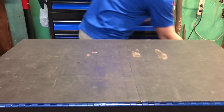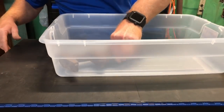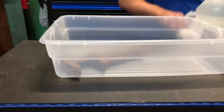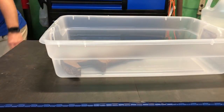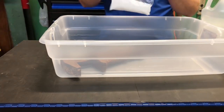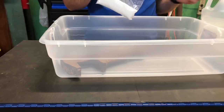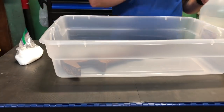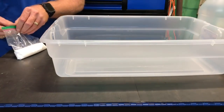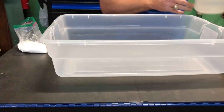Alright, we got the old crusty rusty blowed off. I've got a plastic bin to put it in. The thing that I read said you use one tablespoon of salt per cup of vinegar, let it soak overnight. And when I did a little Google-ization, it said that one cup of salt translates to one gallon. That's what we're going to try. I think what I'm going to do is try to stir this stuff up first — may not be necessary, I don't know. I've never tried to clean a wrench before.